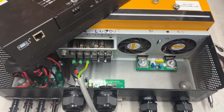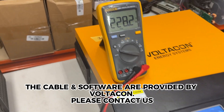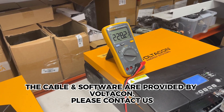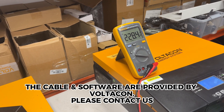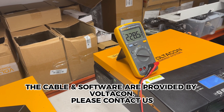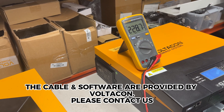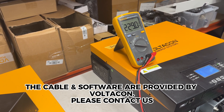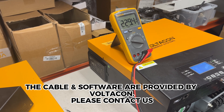We have the same issue on the other inverter, which is now fixed. By sending the voltage command using the programming cable, you will see how the voltage gets back to normal — in small increments of 0.1 volts. As you can see, the voltage is now getting higher. Here we have a communication tool — this is free of charge and we can supply it to our customers. With some very simple instructions, we keep sending this command: 0.1 volts every command, so we can perfectly calibrate the output of the inverter to 230 volts.